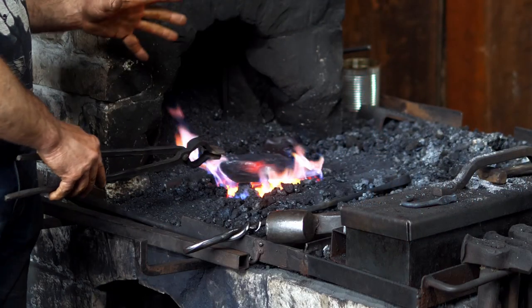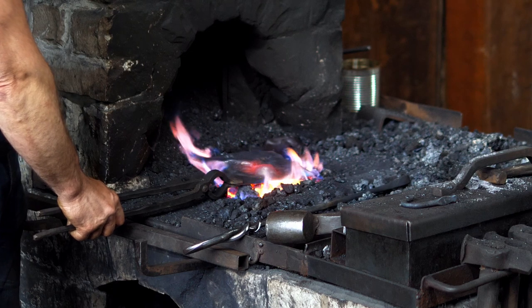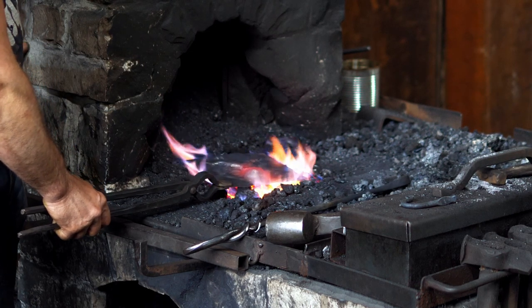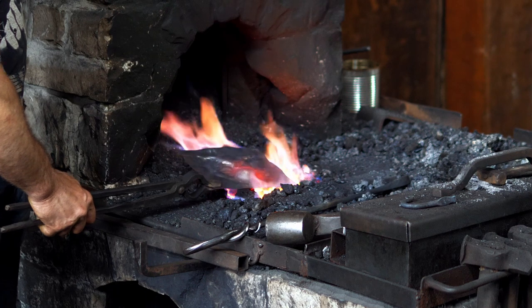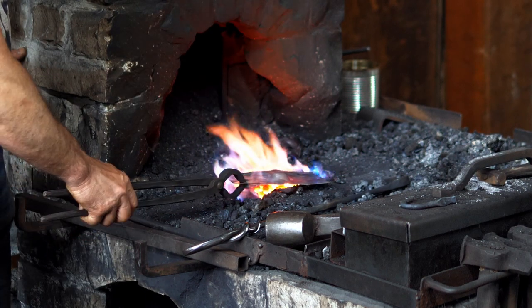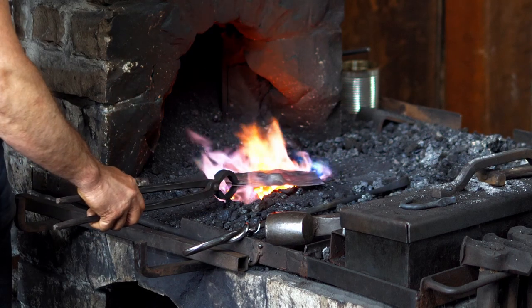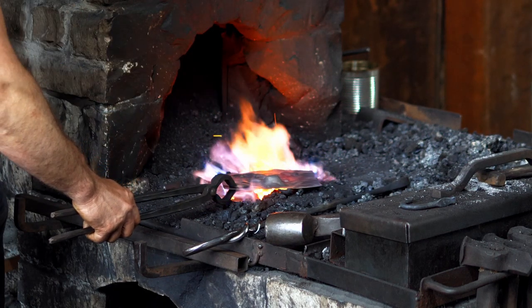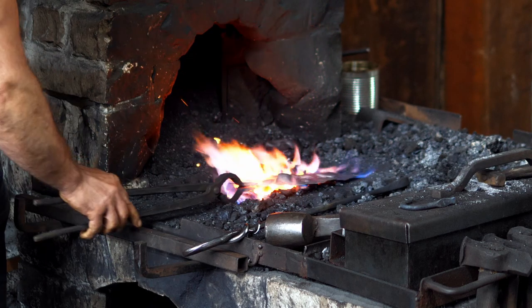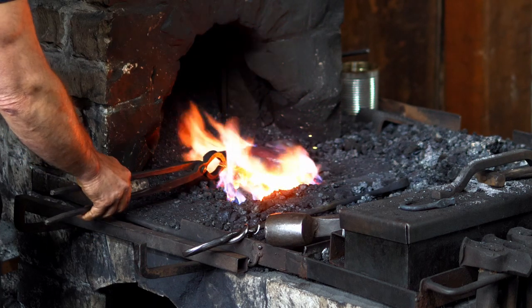You have to be very careful when you're heating up the brass. You want to get some color in there, but it's very easy to go a second too far and the whole piece of brass will deteriorate and you'll destroy it. This becomes ever more important the farther you get into the process. I'm just bringing it up until I see some color and then moving it around to the forge on the hot spot to get a nice even heat over the entire surface.